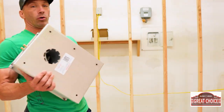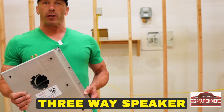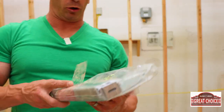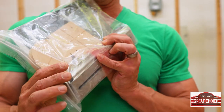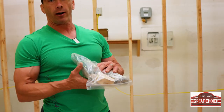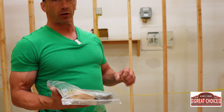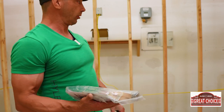The nice thing about James is these are a three-way speaker, so we're going to get some lows, mids, and highs. This hole right here has a cover block, and it's really cool — we can do a square three-inch or a three-inch round depending on whether you're going round or square can line. Since we're doing it on the wall, we're going to have a nice clean fit and finish trim with the sheetrock — nice and flush, barely noticeable, painted the same color.